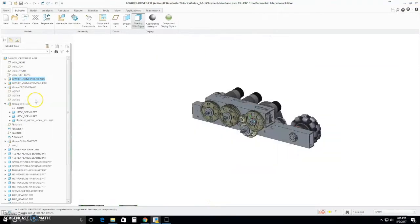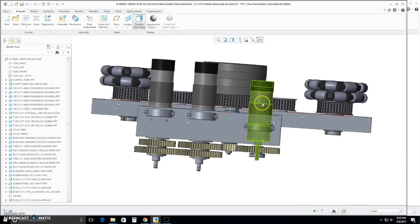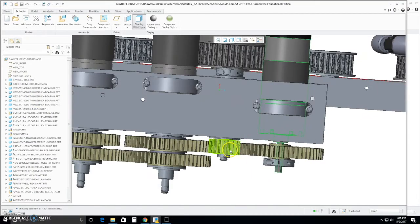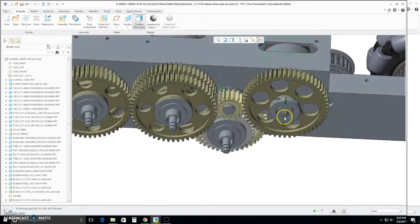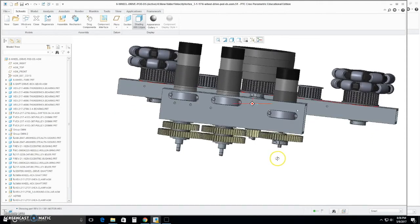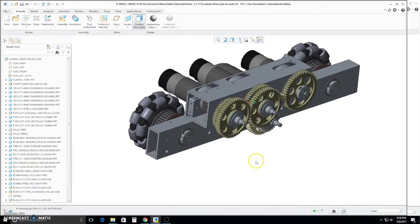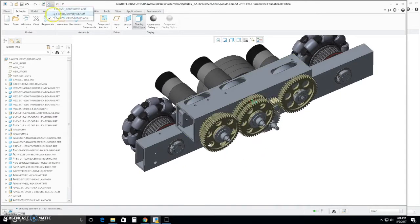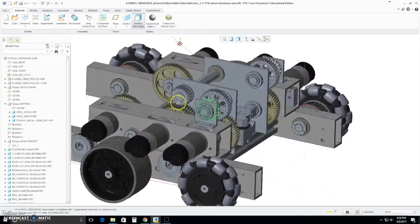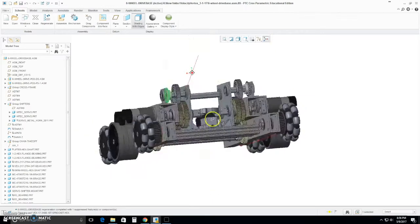Here we can open up a drive pod, and you can see that we're using 3 motors per side, with one being direct driven into the main gear, and so this front motor on each side is always connected to that drive side, so that if the shifters were to fail, we would still have control. We're also using 2 motors here in the back. This far rear one is used for a sweeper in the front, which you can see with this sprocket here. This is chained all the way to the front for our sweeper on our Velocity Vortex Robot, or it could be used for another function.